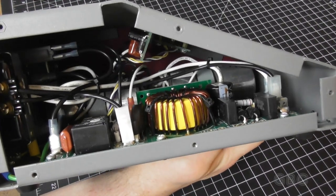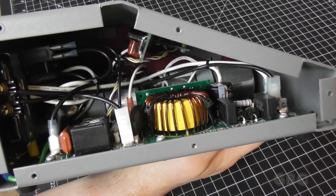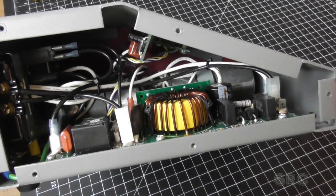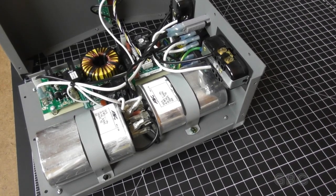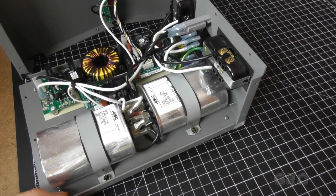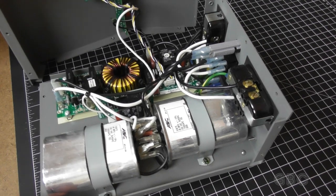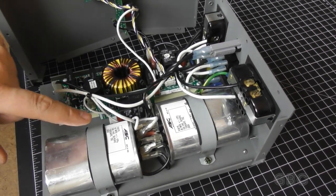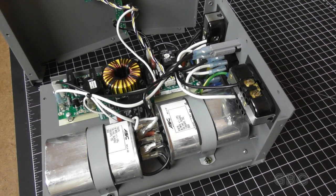You can kind of see on the other side are the two oil-filled capacitors. We'll get a better look at that a little bit later. But there is a massive inductor. I've gone ahead and taken the other side and the top off. Now you can see those two capacitors — both of them are oil-filled. They are 40uF plus or minus 10%, 330V AC.